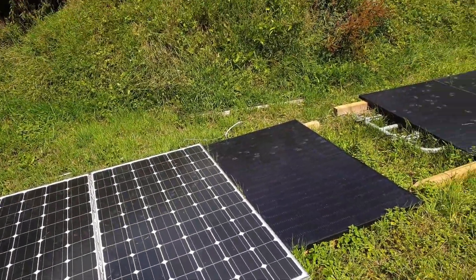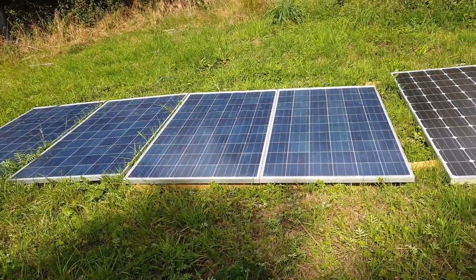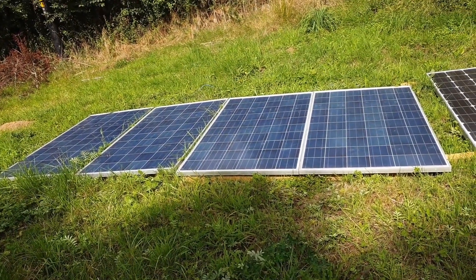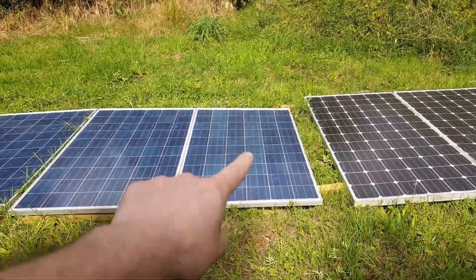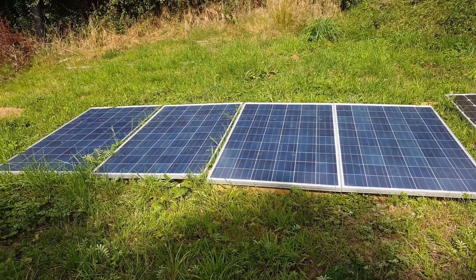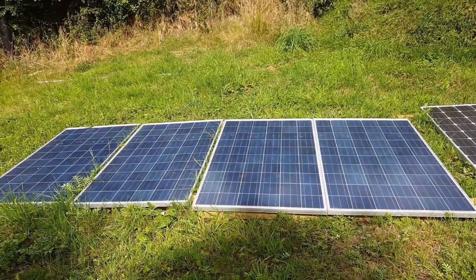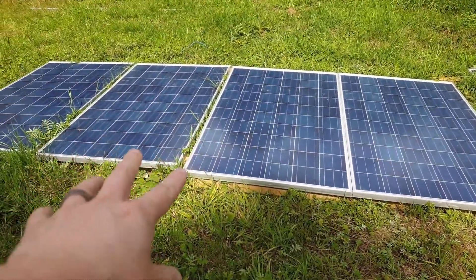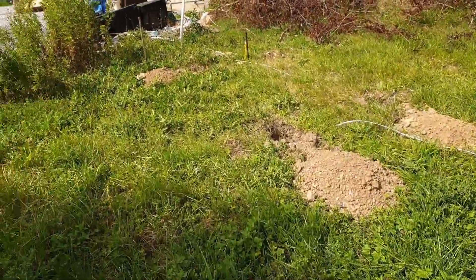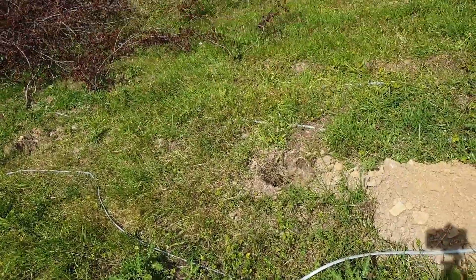These four are part of a bunch that were donated to me recently by a very kind gentleman on the OpenInverter forum. These are 230-watt polycrystalline panels — you'll see they're a blue color versus the black of the mono ones. Polycrystalline panels are much better at creating energy in direct sunlight, so if you're in a sunny country like Spain or Lanzarote these would be ideal. These four are connected in series and then connected in parallel with another four. I have started digging holes for posts and a proper solar mount, but I need to get the PCS sorted first.